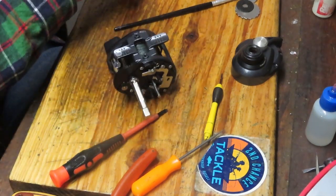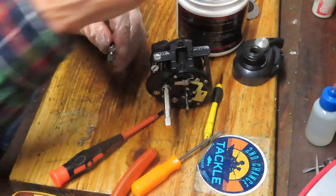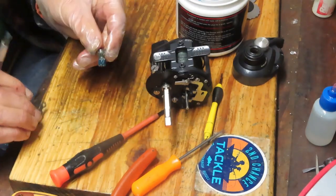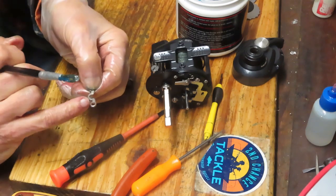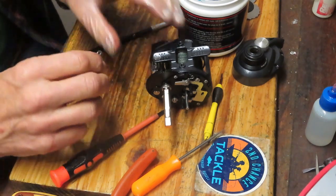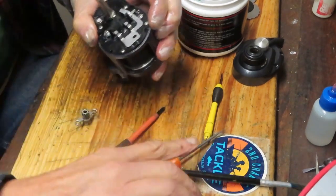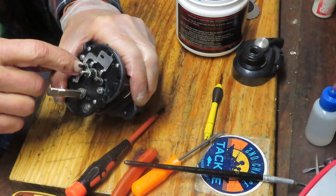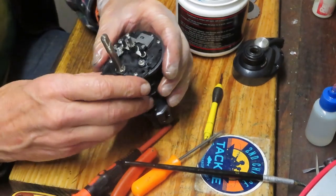We're going to take our pinion gear next. Again, we've cleaned and inspected. We have the yoke. I want to make sure we get a fresh coat of grease onto the teeth of the pinion gear and that little shoulder there. We'll do the same thing here with the yoke. Remember, one side's got the angled section right here that belongs to the side with the spool gear. And then this assembly will go in right over the top. We can actually put a little bit of grease onto the spool shaft at this point as well. Okay, that'll go in like that. And then when you're putting this in, make sure you turn it so that you get this all the way to the back and you have the arm or the cross hatch on the spool intersecting with the gear itself.